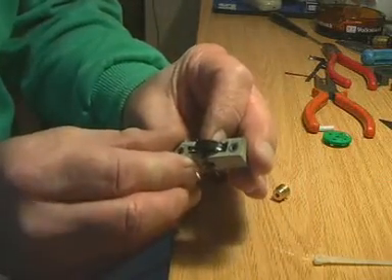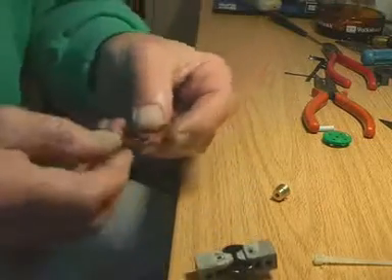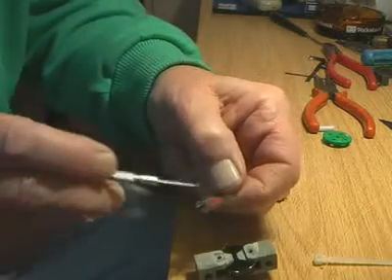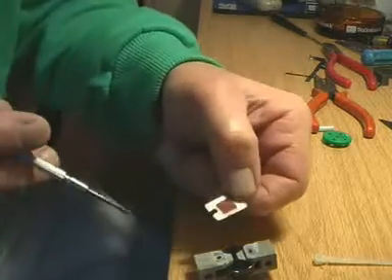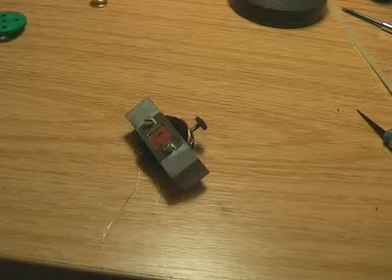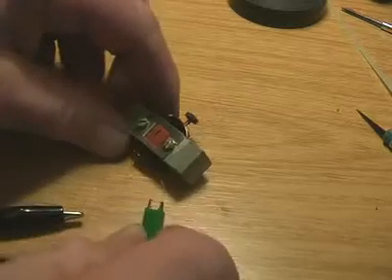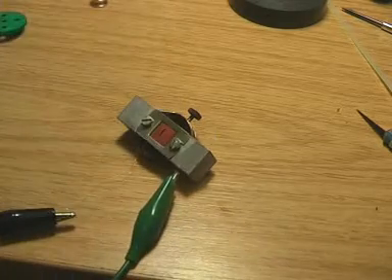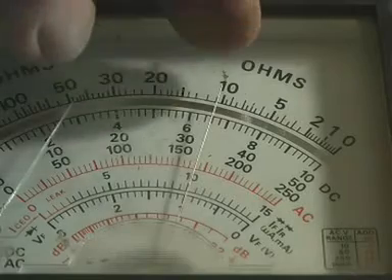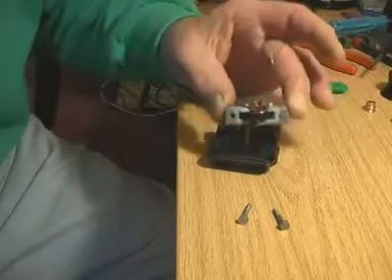The top of the armature goes into this damping piece, which is a piece of rubber that's actually not in bad condition. I'm interchanging some parts from these heads - the rubber in one is completely rock hard, but this isn't bad. We've temporarily jigged it up. Now comes the crucial thing: I want to check for continuity and above all the resistance. I'll get the croc clip on there - what have we got? Same as before: about 100 ohms. Okay, let's carry on.